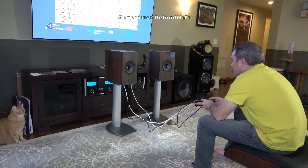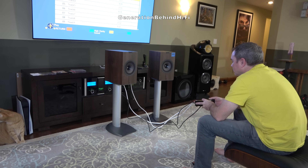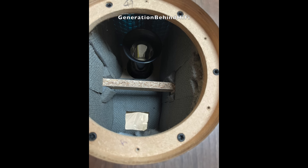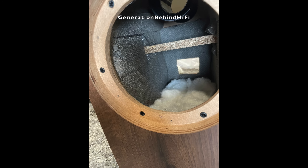In my opinion, there is a nice sound improvement with these upgrades. The biggest improvement I could hear is from the cabinet upgrades, as well as replacing the iron core inductor on the low pass filter with an air core inductor. The Q350 has always sounded a bit boxy to me — meaning the cabinet walls vibrate excessively due to lack of damping material, creating unwanted resonances that color the sound, particularly in the low to mid frequencies. As the spectral decay graph and my own measurements confirmed, there is an overemphasized sound around 300 Hz and between 600 and 700 Hz. By lining the inside walls with quality damping material, the boxy sound is now non-existent and the clarity has improved dramatically.